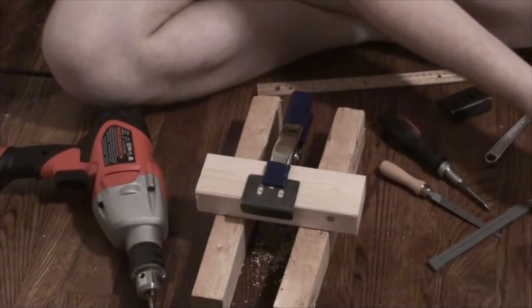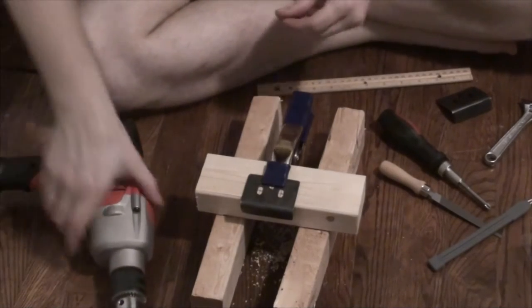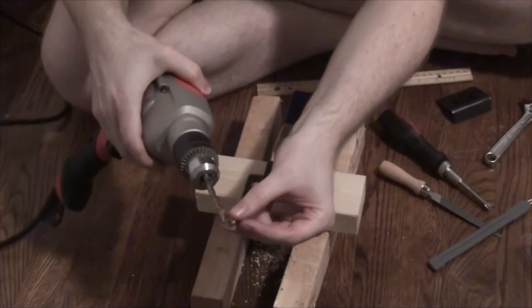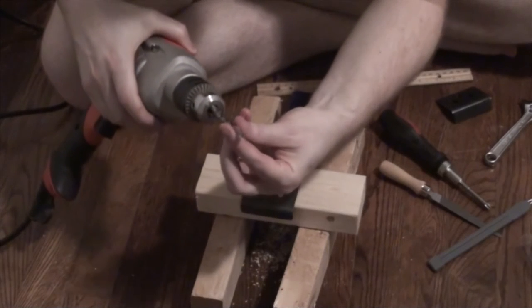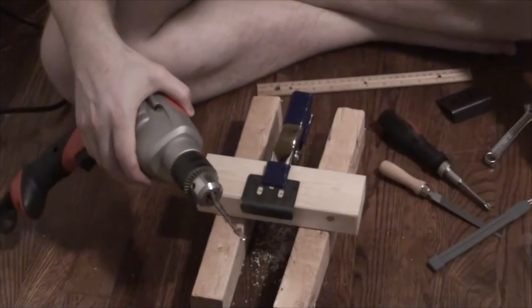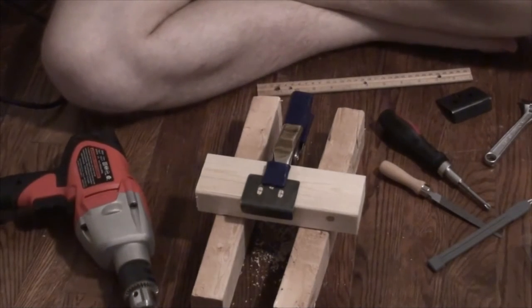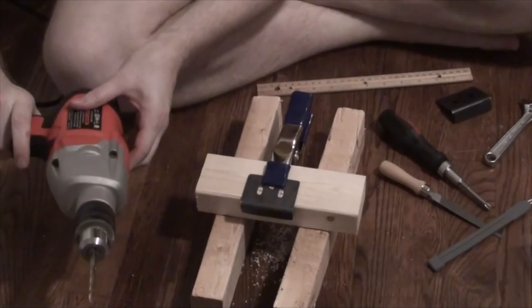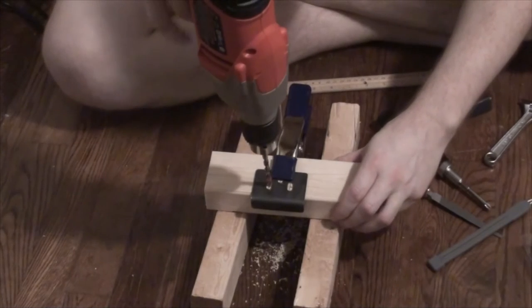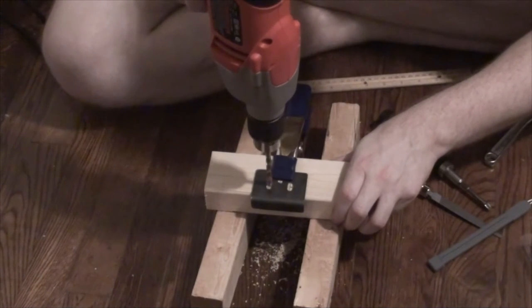I'm using a quarter-inch drill bit. I tried pre-drilling with a smaller drill bit and it didn't actually seem to help — it was better to just go straight to the big one. I unplug it to show that there's a little rubber band around it, which is a little bit deeper than the depth of the threaded insert. That tells me how far I want to drill. The rubber band just seemed like the easy, simple solution to give me some sort of depth guide. So I'm trying to drill just until that's right about touching the surface.